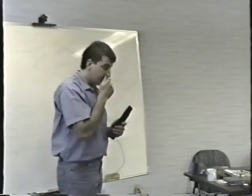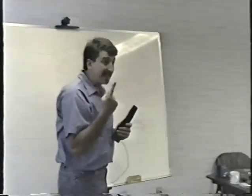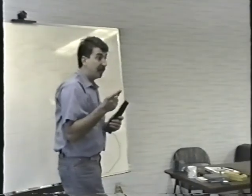There's a few more things that I want to review as far as the power supply is concerned. First of all, let's go back to the problem where the fuse is blowing. It's blowing the fuse. Remember, there's only three things that blow the fuse in the power supply. The most likely thing is those switching transistors. Absolutely the most likely thing.